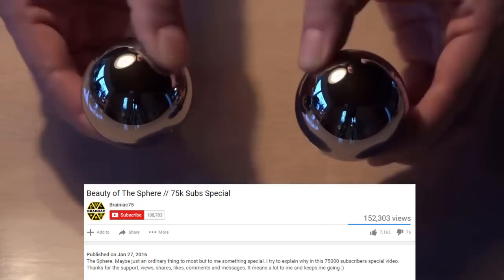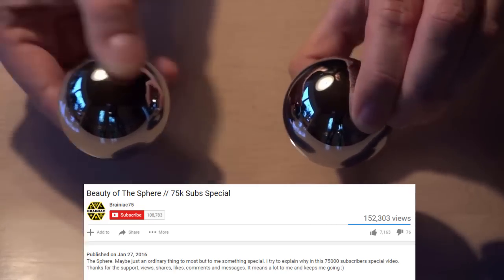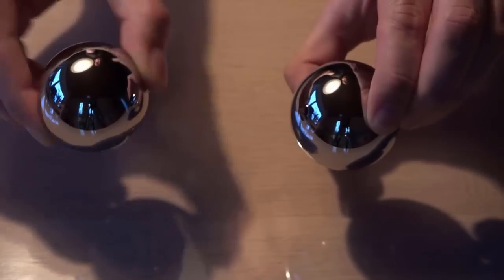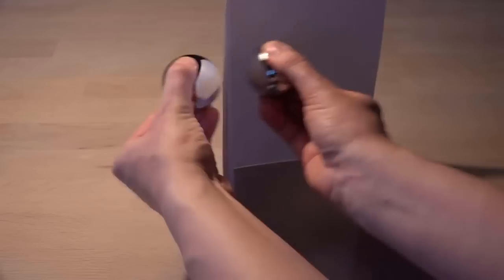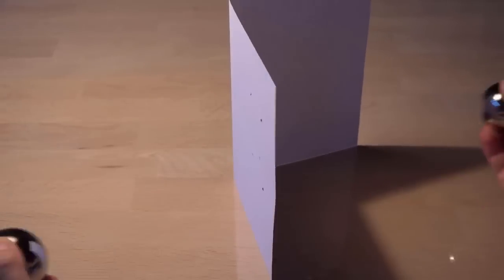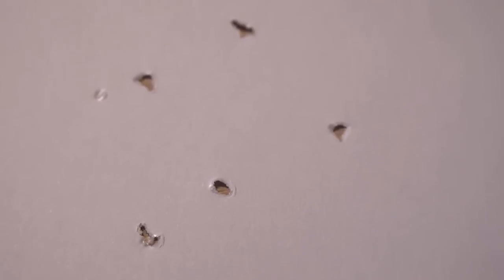These 2-inch chrome steel spheres for a ball bearing are manufactured to fine tolerances and pretty heavy. So when I smash them together, a lot of kinetic energy is released into tiny spots on their surfaces. Most of the energy turns into heat at the impact point, and it is actually enough to char paper. I saw no smoke, but there was a smell of burned paper and brown edges on some of the holes.